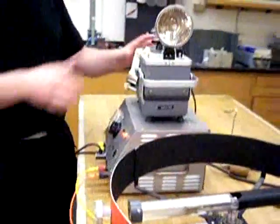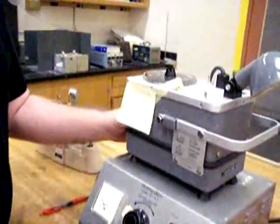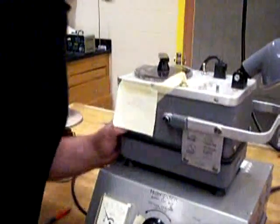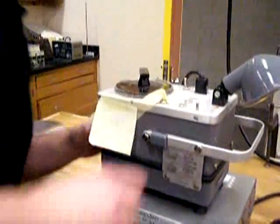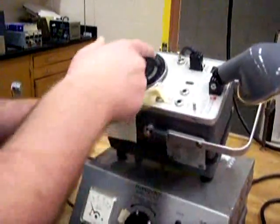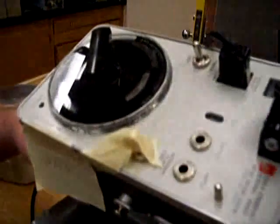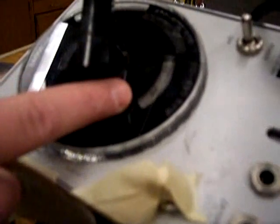With the frequency, if you're tall you can look right over it. If you're short, you can bend it down to you. Each frequency that you'll measure — keep in mind that each division will be five revolutions per minute. So your delta RPM, your reading error, will be half of that: 2.5.